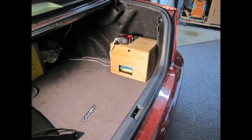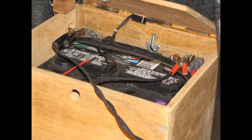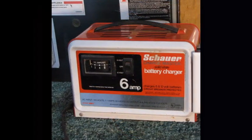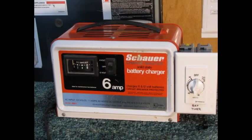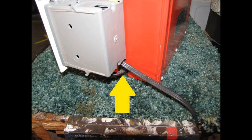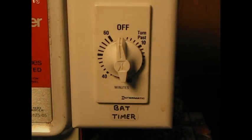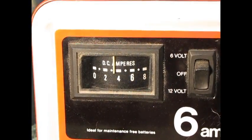I did promise to mention something about charging, so here we go. After a hard day of making videos in my car, I backed the car into the garage, grabbed the electrical leads from my battery charger, opened the lid, and hooked up my wires. The red and green felt markers really help with correct hookup. I don't want to leave the charger hooked up all night — that would overcharge the battery — so to fix this, install a timer. This is just your standard bathroom fan timer from any home improvement store. Mount an electrical box on the side of your charger, route the power cord out of the charger into the electrical box, through the timer, then out of the box so you can plug it in. Cut the hot lead, route it through the timer, and back to the charger — giving you up to an hour's worth of charge time. Since I only put a drain on the battery for 50 minutes a day, one hour is plenty of time to recharge.